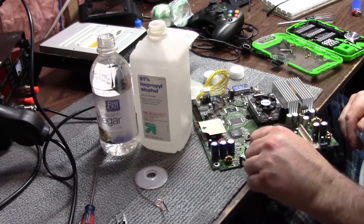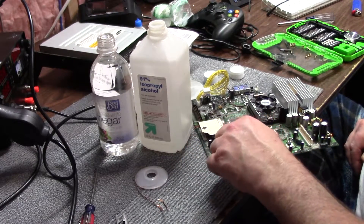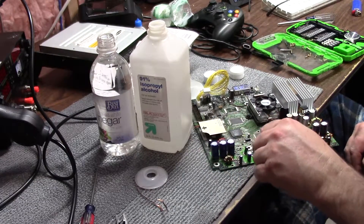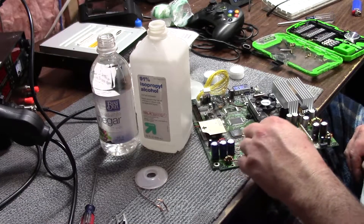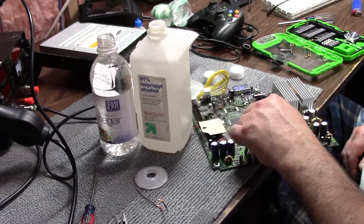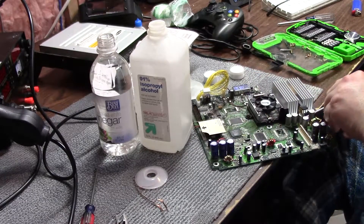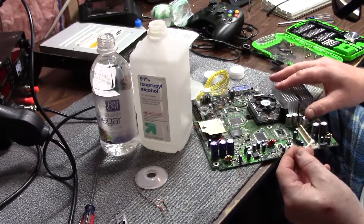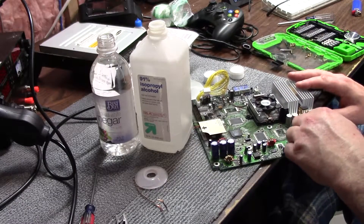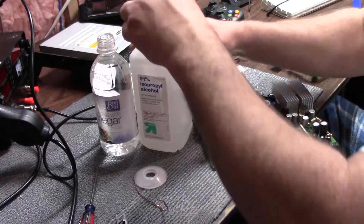The dust again — saves the component, but still we're going to clean everything and I'm going to clean this fan out, because apparently the place where this Xbox was stored or used was in a very, very dirty location. There's a spot for extra RAM on these boards — that's crazy. This gives me a chance to visually inspect any other components. We could do new thermal paste, that kind of thing — just give it its 20-year bath and make sure everything looks totally fine.